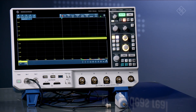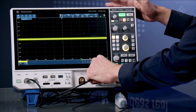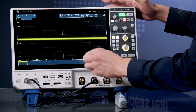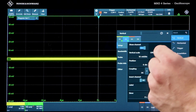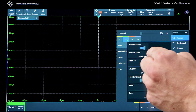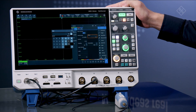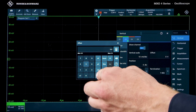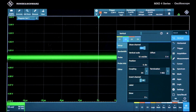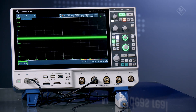I'll now connect it to a 5 volt rail. I'll open channel 2 and remove channel 1. The MX04 has an industry-best plus or minus 5 volts of offset at 1 millivolt per division, meaning you can zoom in to scale DC signals using all 12 bits of the instrument's ADC.